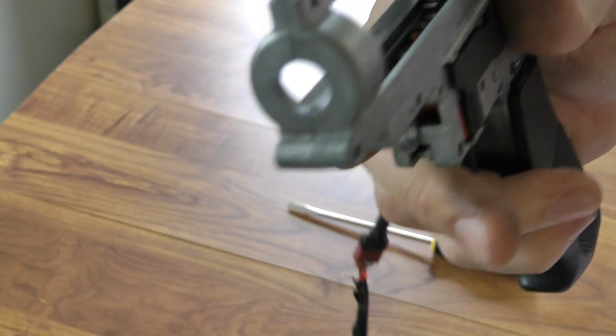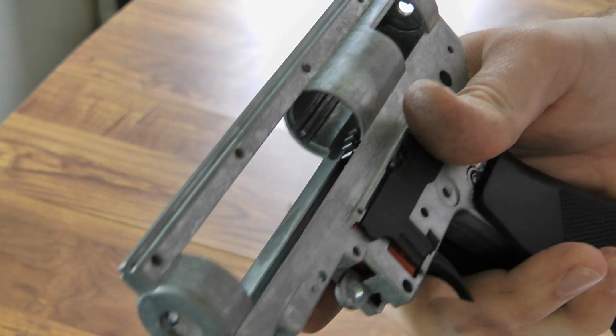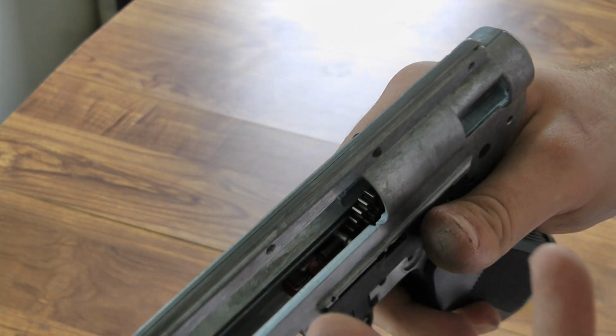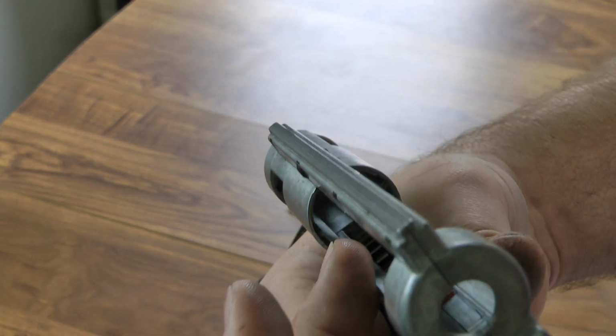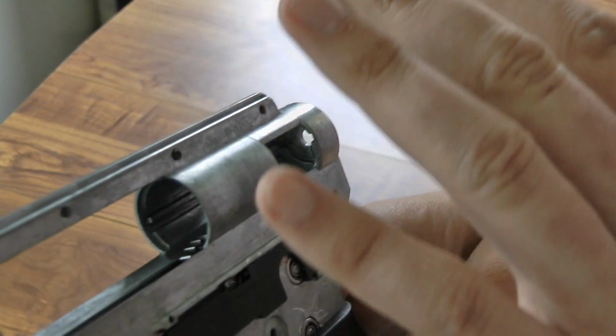It's a great little tool, this, for checking and testing, and then stressing the gears out and just making sure that they are operating before you add the strain of the spring and all the other stuff to potentially block what you can actually see is going on. So I just thought I'd let you guys know. Just a nice little tool there for any gun techs out there, or people having issues with shimming or trigger contacts or motor heights, that kind of thing. You can do it all before you add the top portion in.